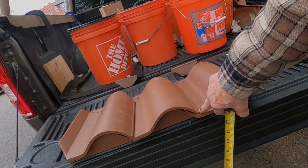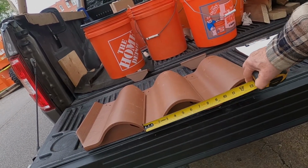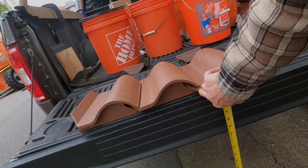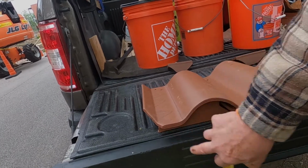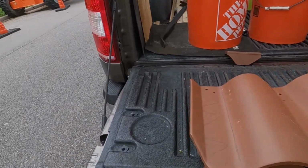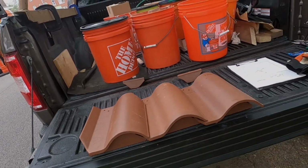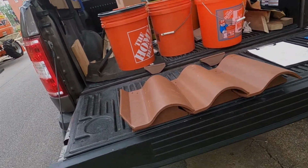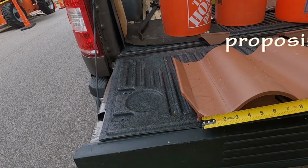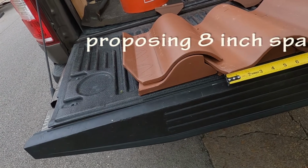I was kind of using this outside edge because that's, you know, your exposure is from this outside edge to that outside edge. But that will make it a lot more convenient to take this where it's cut off as the part where we set the chalk line, which is going to be a little bit to the inside, 1/4 of an inch or so. Well, 3/8 from the crease to the edge.